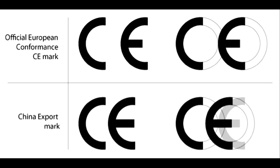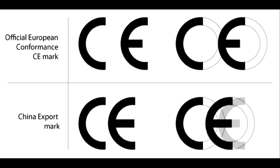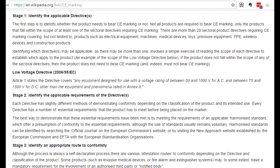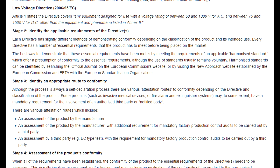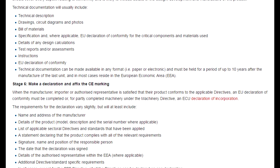There's one common misconception about the CE mark that should be cleared up — the so-called 'fake CE mark' that supposedly means 'China Export.' It does actually look different to the formal CE mark, as the spacing of the characters is quite different. However, there is actually no such thing as the China Export mark. And whilst there is a formal correct way to draw the CE logo, it's not uncommon for genuine products from big-name manufacturers to have this incorrect. So seeing an incorrect marking is not necessarily an indication of a fake or non-compliant product. The China Export mark is a myth.